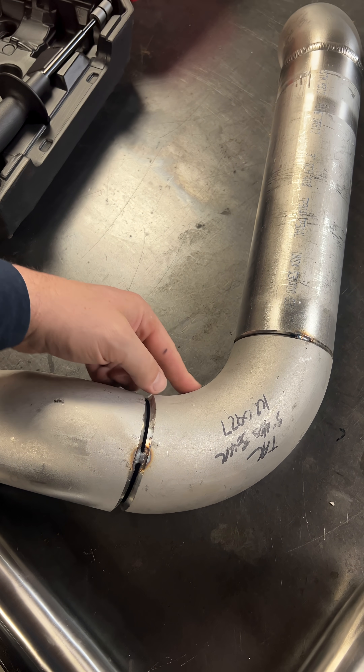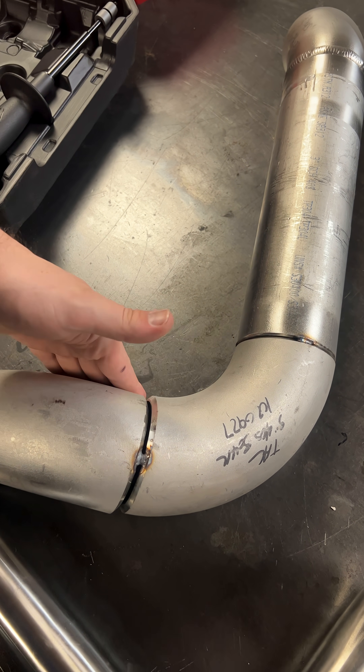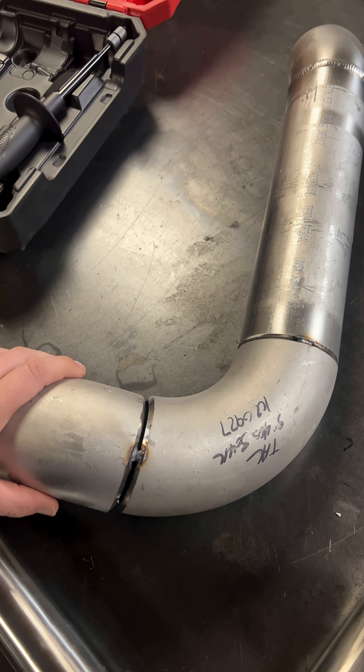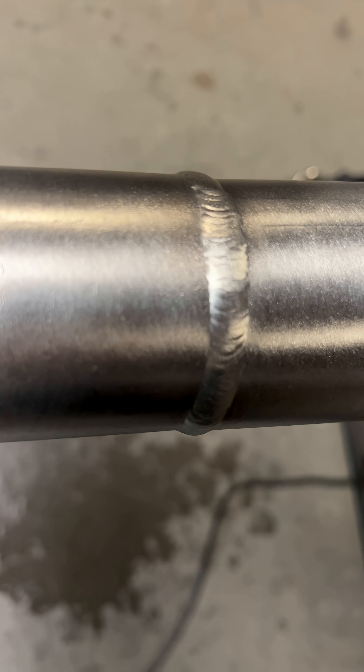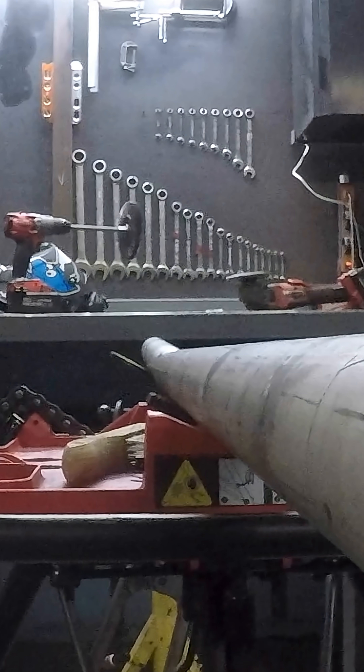Also, the throat side of the 90s and T's pulls more than the back side. So weld the back side first, ending opposite of the throat. And if you disregard all of this, you'll probably end up with a banana, kind of like I just did. Follow for more tips.